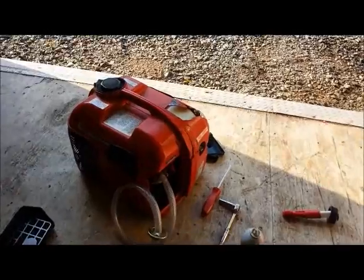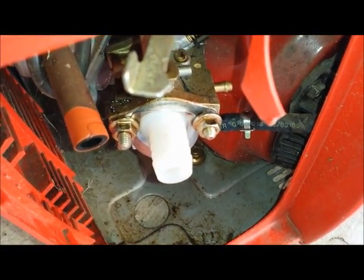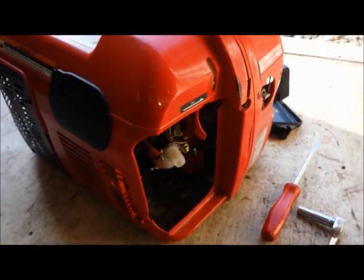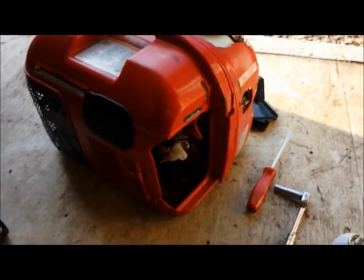What I've done on the front of the generator is — I don't want to break it — I've fastened this nipple just to the air filter, or air cleaner there, and it lets me plug this hose on it. So for the first test, we'll leave that off, and I will run this amount of fuel poured into the jar, hook that up to the carburetor, fire it up, start the stopwatch, and run it for five minutes. I'll then report back how much fuel it's used.